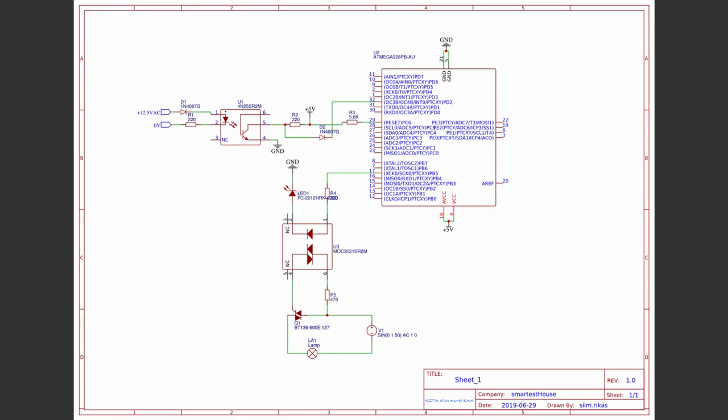When the LED in the opto-isolator is turned on, current can flow through here. Here, mains voltage is used to trigger the triac, and the resistor is for limiting the current that goes through the isolator. Once triggered, current flows down this path, to our lamp, and then to the neutral terminal, thus lighting up the lamp. At the moment, this circuit doesn't have any fusing or really any safety features apart from the opto-isolators. It's dangerous and not really pretty, but it works.